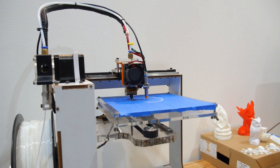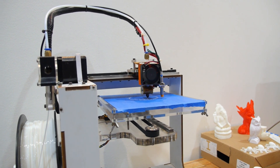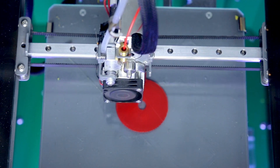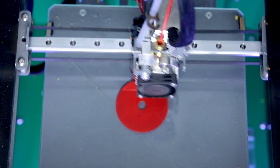We're going to talk about a concept called retraction. We've got our printer nozzle and our filament — in this case the flexible TPU. A Bowden style hot end feeds the filament from up higher through a tube into the hot end and nozzle. The downside is you can get bending and flexing before the hot end, which can cause jams and makes printing flexible filaments harder. Printers like the Ender 3 and Ender 3 Pro are Bowden style. The other type is direct drive, like the Prusa Mark III S, where the gears are right above the nozzle, leaving less room for bending — making it easier to work with flexible materials.